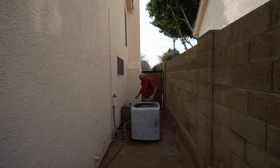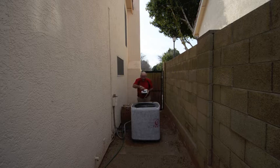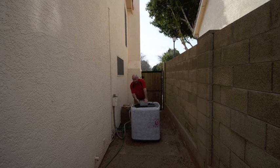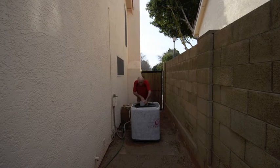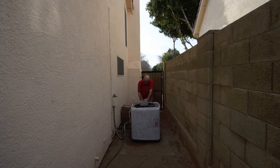The next item to install is our master control box. This you need to mount. It has a control flapper in the end here. That needs to be sufficiently over the airflow so that when the condenser starts up, it operates the control flapper. And as you can see here on the side, we've got the spring-loaded hooks, which you just drop over whatever, as in this case they're straight, but if some of them have a grid system, and secure it in place.